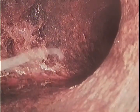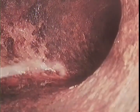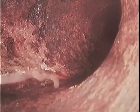We come up here to a Y fitting. The rest of the house ties in at the left side — it actually hits directly in this wall. So with all the scaling that was going on further down, it was causing it to back up out of this backwater valve and then start to act up out of this toilet first. This should prevent that.